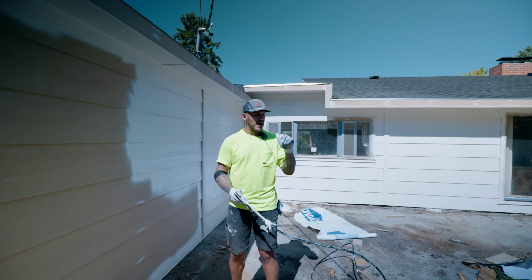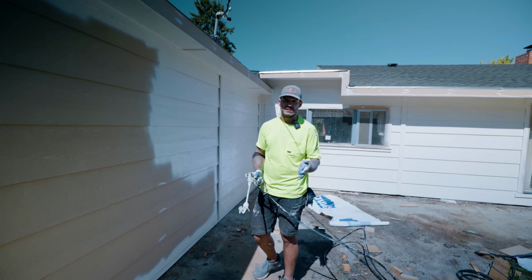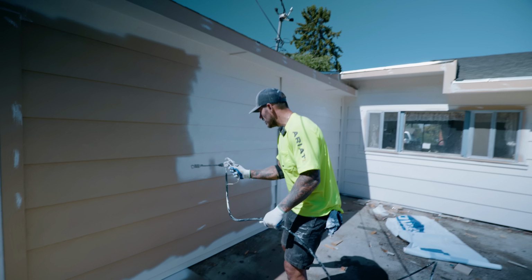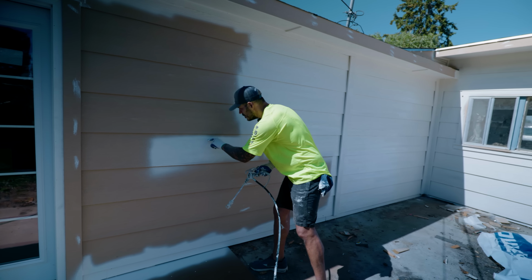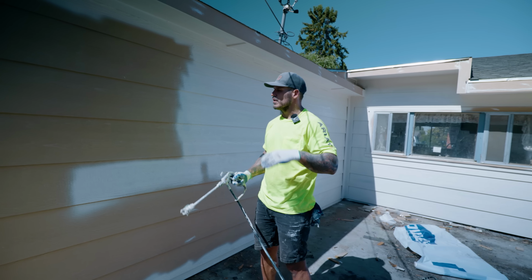And the sprayer, I've used this Wagner 170 on multiple projects, and here's how you can tell it's a good sprayer. First of all, there's no crazy adjustments you need to make. We have a nice even fan pattern. Usually when there's a break in the middle and the outside, that's when you have to increase the flow. We can't control the flow, it's perfect.